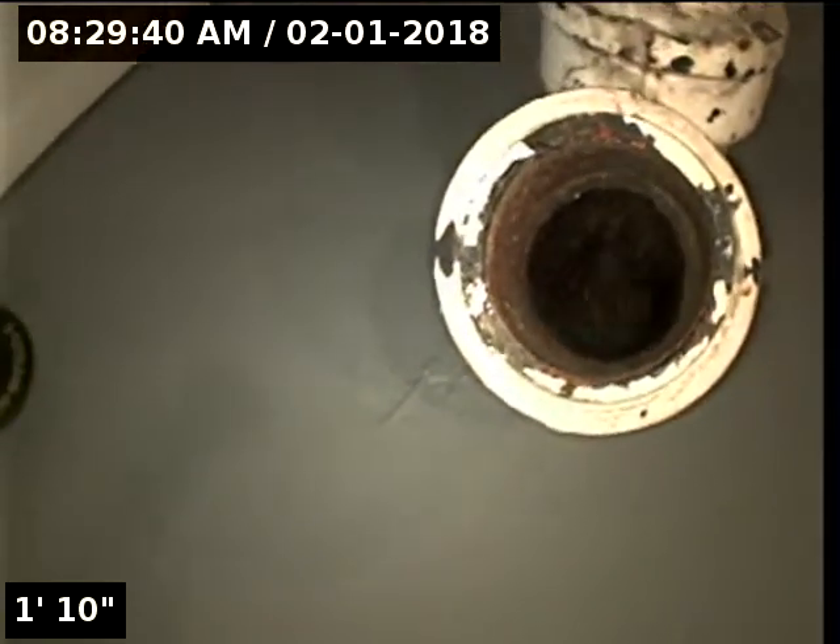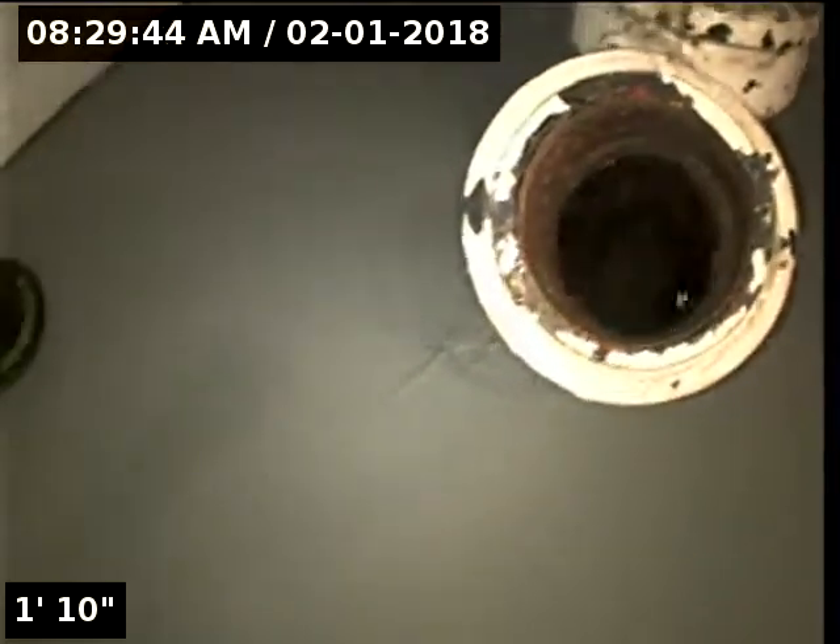Hello, this is Seth Lewis from Lincoln Home Inspections. I'm here to perform a sewer line camera inspection on property 7135 North Commercial Avenue, Portland, Oregon 97217. The current time is 8:29 a.m. on February 1st, 2018. The house is facing east. I'm in the northwest side of the basement where I've located a 4-inch cast iron clean-out. This is where I'll be accessing the line for inspection. I have water running from the kitchen sink — the water is draining downwards from the kitchen. The purpose of this inspection is to determine the overall condition and serviceability of the sewer lateral for this property to the city main.